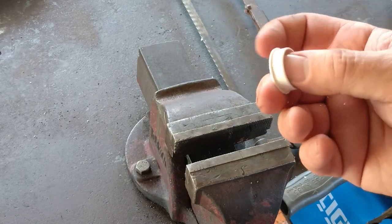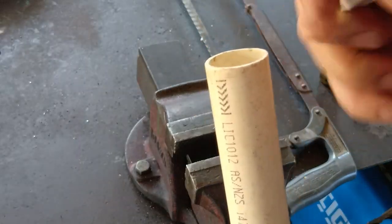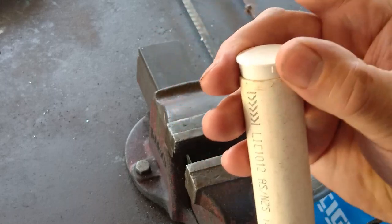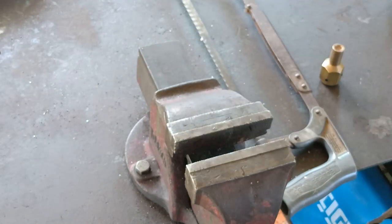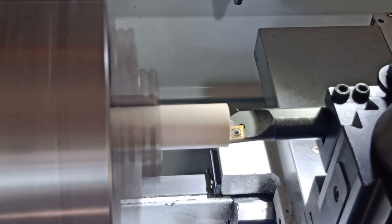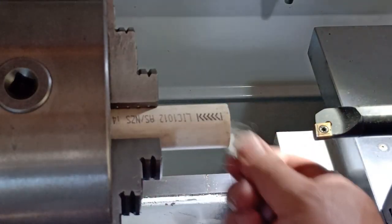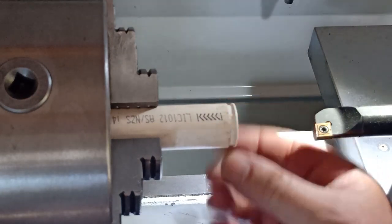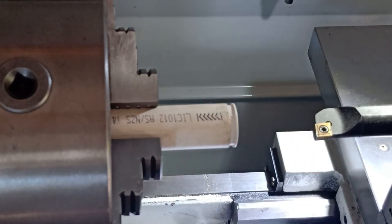I've got a cap which is out of a J-box type thing - it doesn't quite fit, so I'm just going to put this in the lathe and just take a smidgen off the inside there, just so I can glue that cap in the end and it should work alright. That fits perfect - it's got a little lip here, I might just file those off on that cap, and they'll glue in there just nicely.